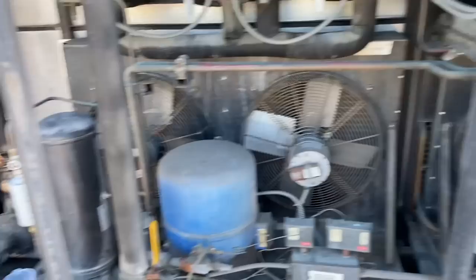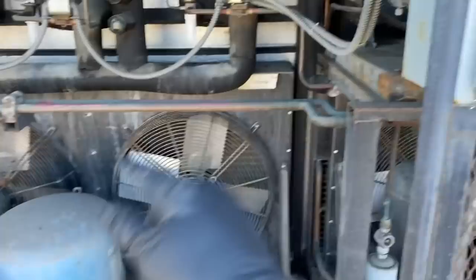I'm going to have to take a dive down here and see what's happening with this compressor. I'll go ahead and turn this off. I think this compressor's failed — that's why it was off. I got the disconnect off, now I'm going to have to ohm out that compressor.